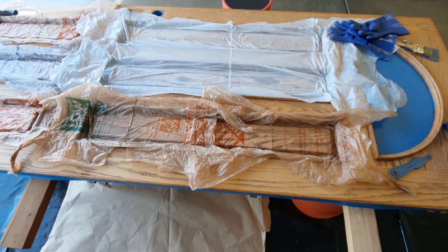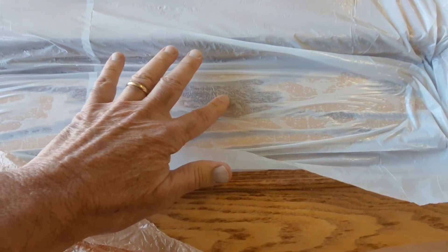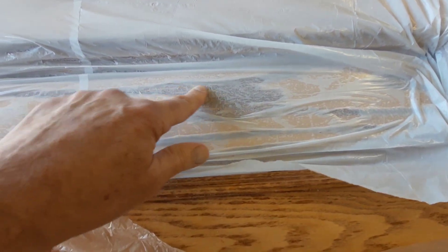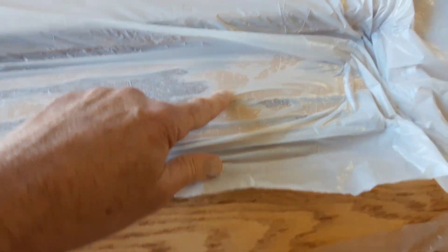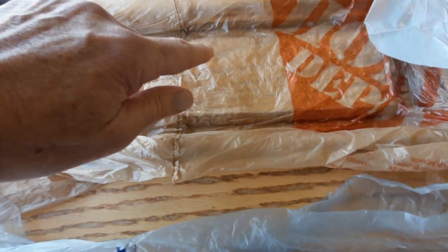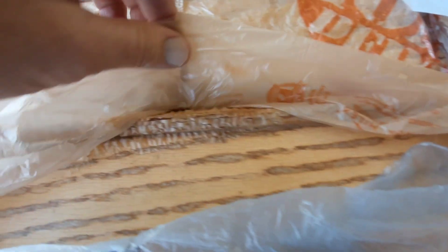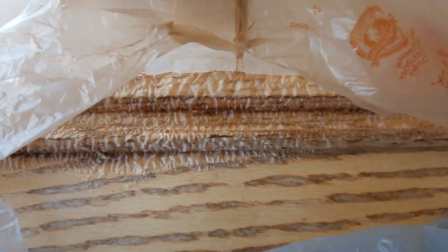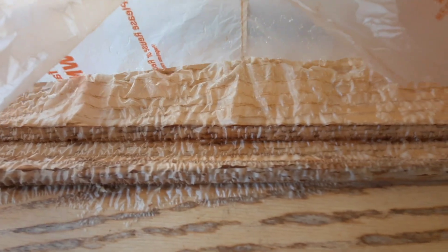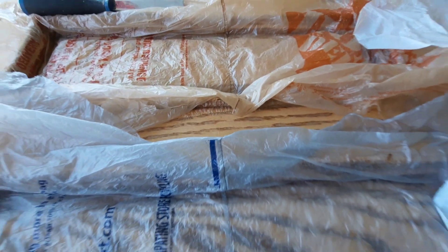We'll finish up the trim tomorrow and then apply the same technique to the rest of the door. I'm super happy that even though this was not in the instructions, it was much more effective and allowed us to take it off in basically one coat. You can see this wood is not as wet or dark as the other two panels were. We've got all the panels finished — stripper applied. Where the plastic is still adhering, there's nothing to peel off, but where the polyurethane is pushing up the plastic, it's ready to come off — practically on its own.